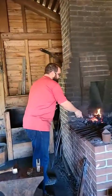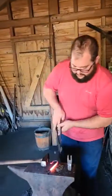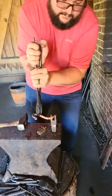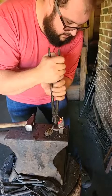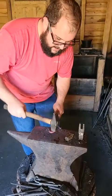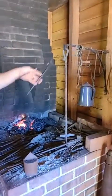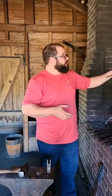So, one done. Let's see how it's soaked up — it's soaked up good heat. I did that curl again. I'm just going to change the way I hold it, stick it in my fingers — my tong fingers, not my actual fingers. Nobody panic. All I'm doing is just a little bit there. Notice I need to bring that back around a little bit — not a big deal, it's a very easy thing to do. Straighten that up, put it in the other side. Let's see how that hangs. I'm not worried about a pot coming off of there, so I may just leave it alone. I'll let that cool because it's still red hot — I'll let it cool for just a couple seconds, not going to quench it, and I'll hit it with the same wax as before.